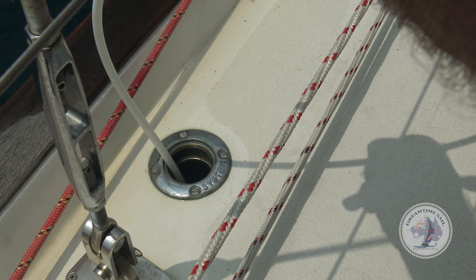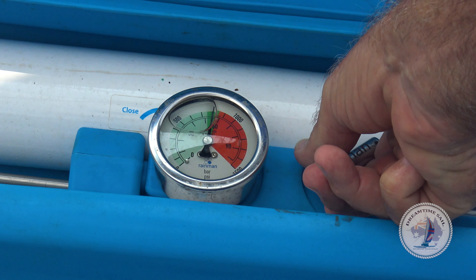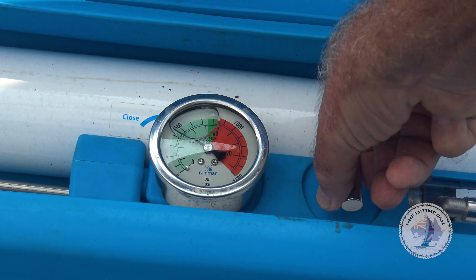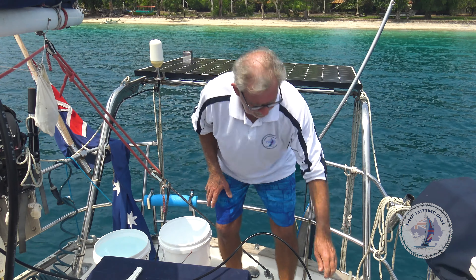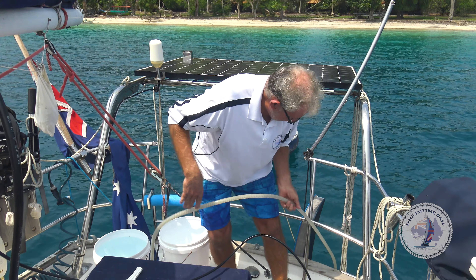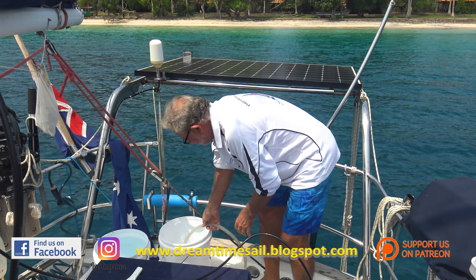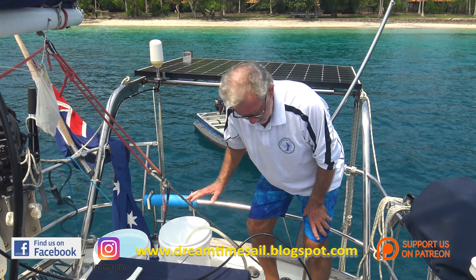At that rate it doesn't take long to fill our big tanks. When we're finished making water, we slowly back off the pressure, then set up for the flush. We turn the unit off, bring the intake line up, take the strainer off, and put it in our flush bucket, running that nice clean fresh water-maker water back through everything.